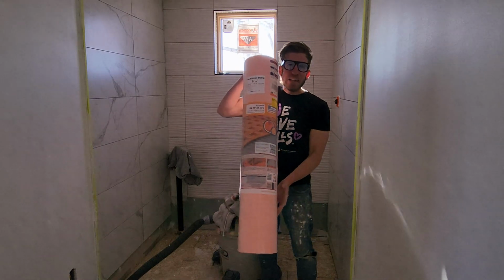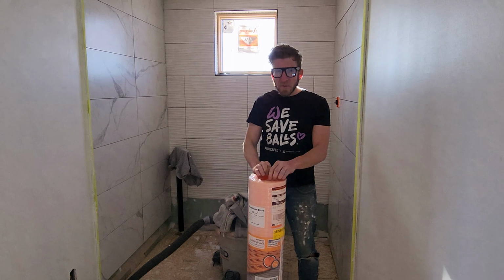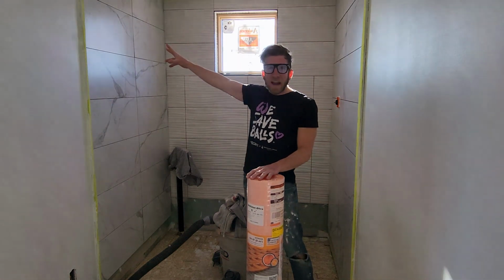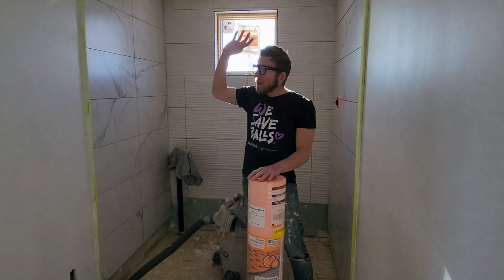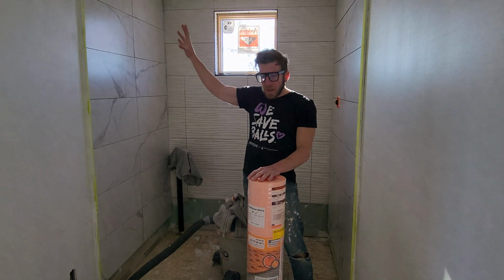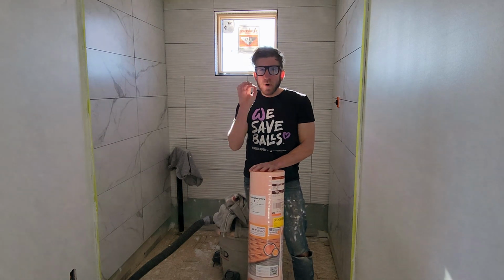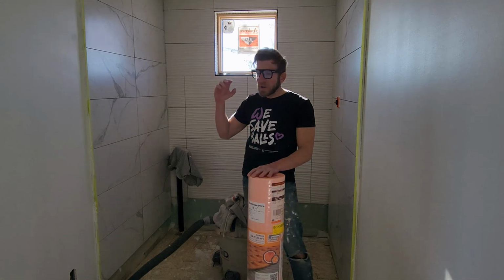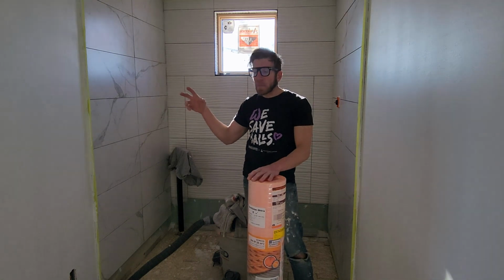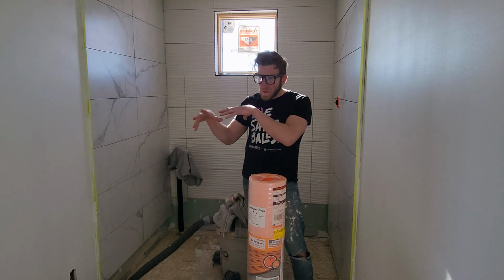Also, I noticed while I was editing this video, I didn't really show you how to cut tile. It's really simple. If you've used a miter saw or a table saw before, the same method applies. My dad actually loaned me his old professional tile saw. It worked pretty good, super easy to use. The tile saws are wet tile saws, so it will actually spit water on your tile while it cuts. Obviously, do use a respirator and do use ear and eye protection as well.